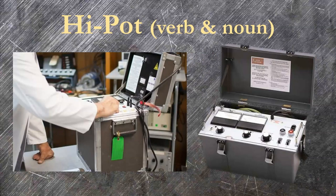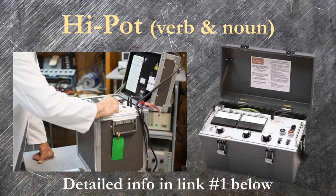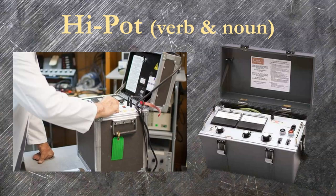The high pot test is performed with a high pot test set, or high potential test set. Just like the Megger, it's used to apply a high voltage to a piece of equipment to verify that the insulation can withstand the voltage applied. If you're reading a spec or test sheet that says dielectric withstand test, just replace that in your head with high pot. These typically output AC instead of DC and have a guarded return lead, which allows the technician to better discriminate which source of leakage current they're actually measuring.